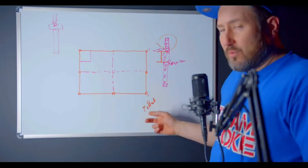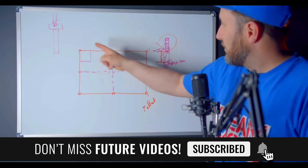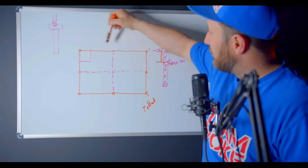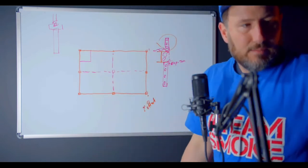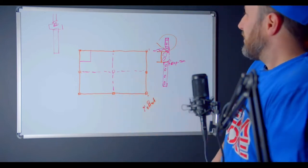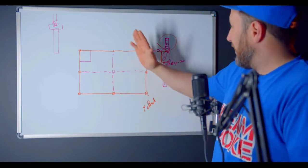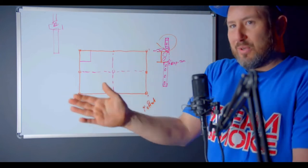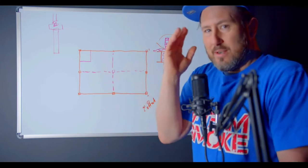So set your rotating laser up, 2-inch offset, and check your corners, okay? All the way around. When you go to do this wall, same thing. You're going to check and adjust your layout in or out, so it works. Now, whatever you do, make sure it's not too far, like, crooked. You keep adjusting, bring it in, okay, until you got a nice even number.